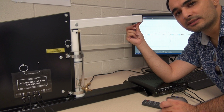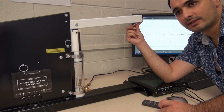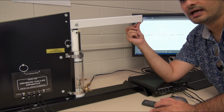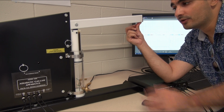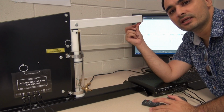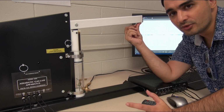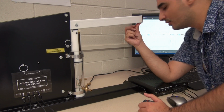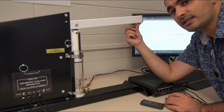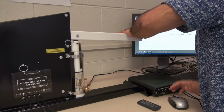Again, I'm repeating, this process should be adiabatic. And our research shows that for this apparatus, if you want a real adiabatic process, your pressurizing process should be under 0.2 seconds. So it should be very fast, but not so hard as to break the apparatus. Let's do it. I'm going to press the record button and immediately start pressing the handle.